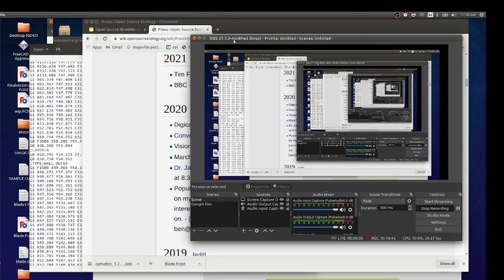So we've got the selector switch, and then we have an Arduino, and then connect it to the whole hydraulic system through solenoid valves, which are these large things, the pressure sustaining things. Those are the things we turn on, just like the gas solenoid on a torch table, which is a small thing that just turns on gas at low pressures. Here we've got these sizable solenoids because they're rated for 3,000 psi. They've got to have enough meat on them to hold that. But through the microcontroller and a little board, the relay, that's what's giving the couple of amps, like 2 amps at 12 volts, for the actual solenoids.